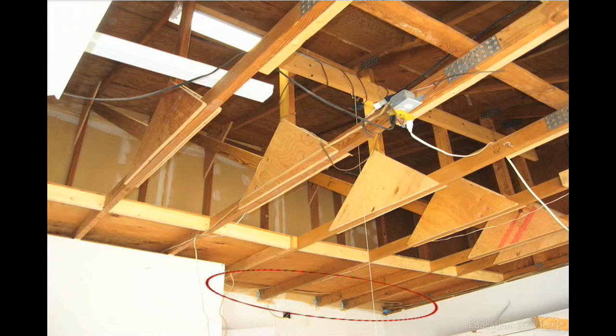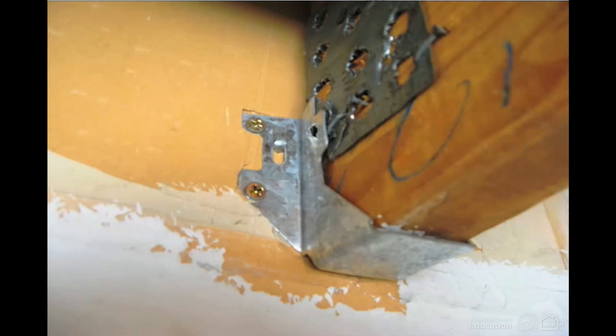These trusses would have been best supported by bearing directly on wall framing. Next best would be an engineered designed ledger or engineer specified hardware. And that may have been how they were originally built, but by the time I inspected them, the 24-foot roof trusses were being supported by joist hangers designed to support 2x4 joists. And the hangers were fastened with 4 gold deck screws each.